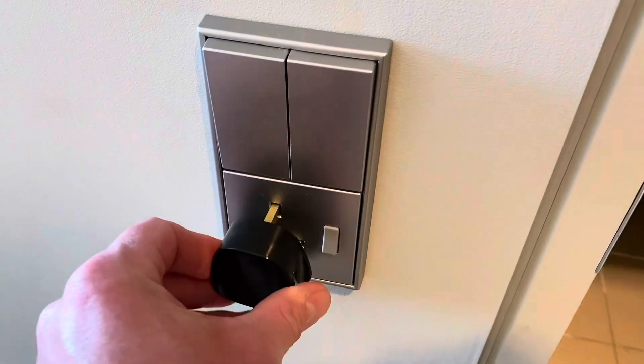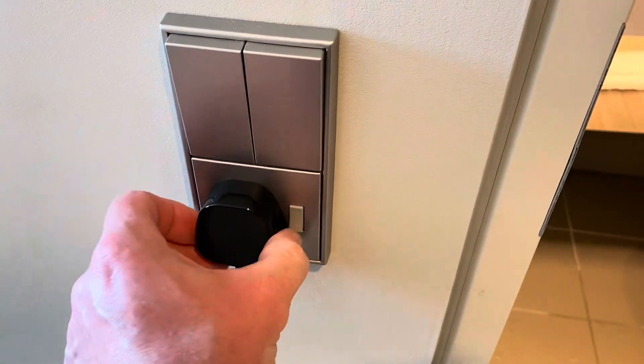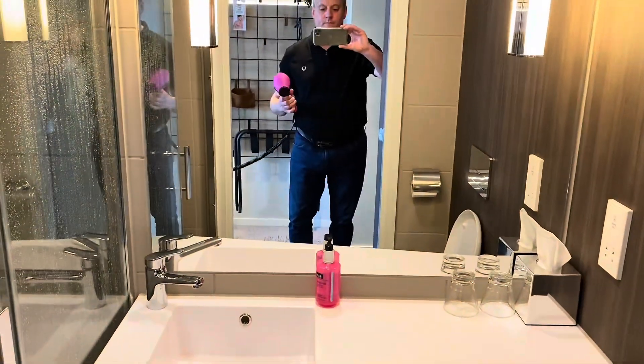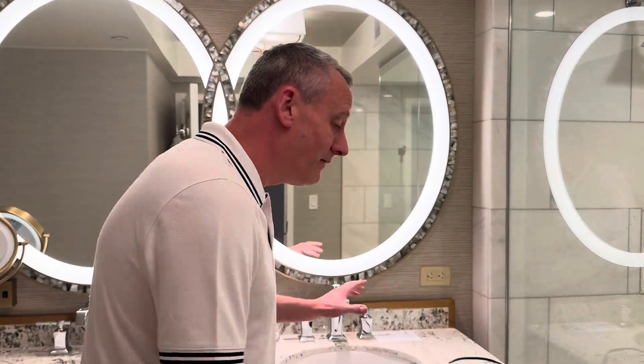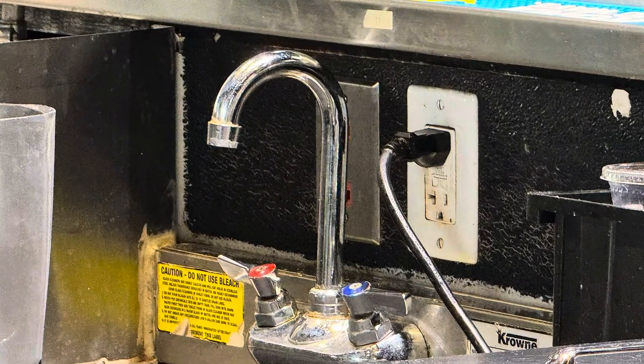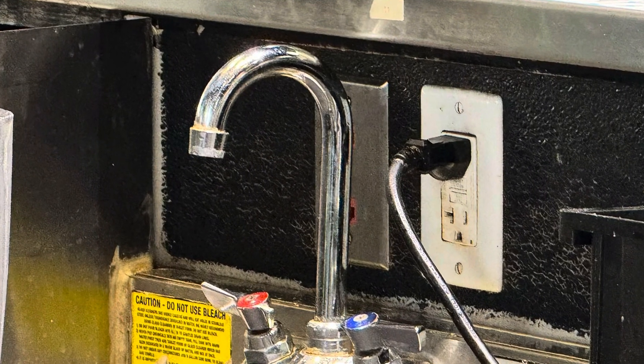Will we be moving in the UK? We've recently cut half a metre off the rule — from three metres down to 2.5 metres — for where we can place our standard BS 1363 socket outlets. Are we moving more towards what's set out in America and Europe regarding the position of receptacles near sink areas? I saw one in a sports bar where the socket outlet was directly behind the tap — it couldn't get any closer to the water source.